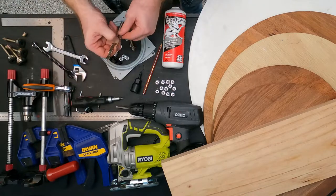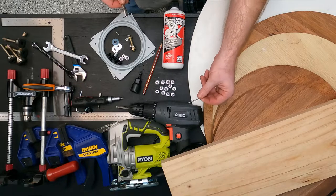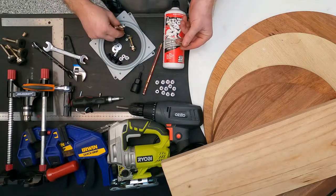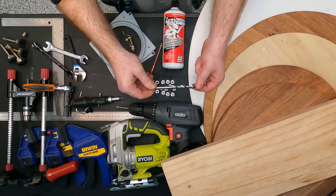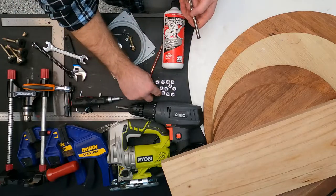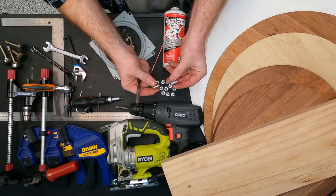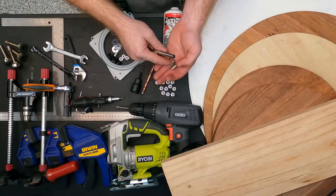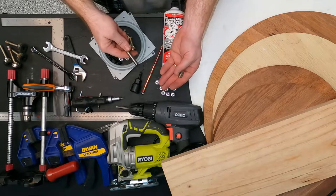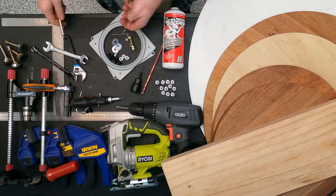You will also need a very, very small drill bit, and that's to basically make a pilot hole for the actual screws. You will actually need also a 9mm drill bit, and that is actually for both of them. Okay, so as I said before, the outer is actually the same size, it's the inside that's the smaller bit. So both the M8 and the M6 insert require a 9mm drill bit. Okay,